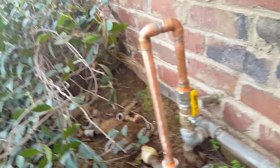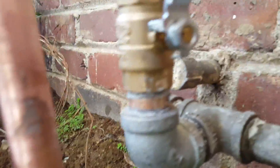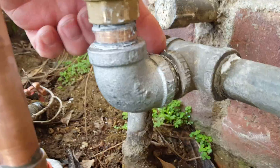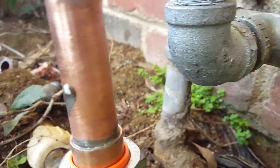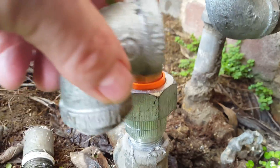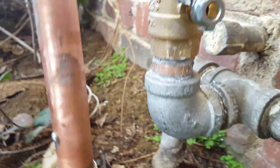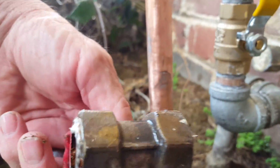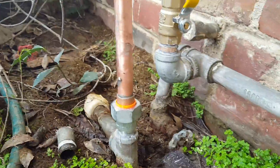We're here in Clubs, California and we've got a little repair that we did. These two pipes are tied together right here at this tee, and then this fitting — we had a little pipe nipple right here that came out of there, and then this 90 turned and went straight in and tied in with that gate valve. Well, the gate valve split and was spraying water everywhere. No way to repair it straight back in line because there were no unions.